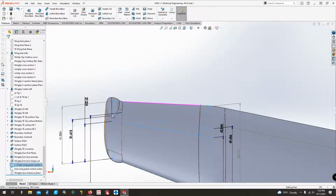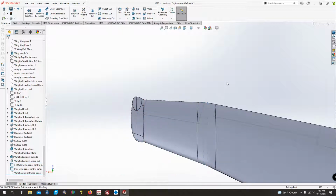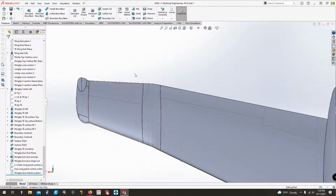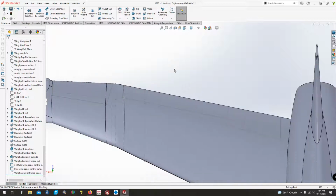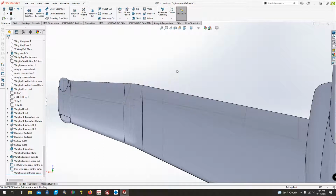And this whole duct thing out here was just a way for it to use airflow through this wingtip duct to help boost the rudder effectiveness at speed. It's kind of a unique surface that pretty much the XB-35s and the YB-49s, they all use a similar setup. They just didn't use this air boosted thing because I believe by then they were at size of airplanes where hydraulically boosted surfaces were kind of becoming a thing, and they probably figured out cable surfaces they could afford a little bit more weight.